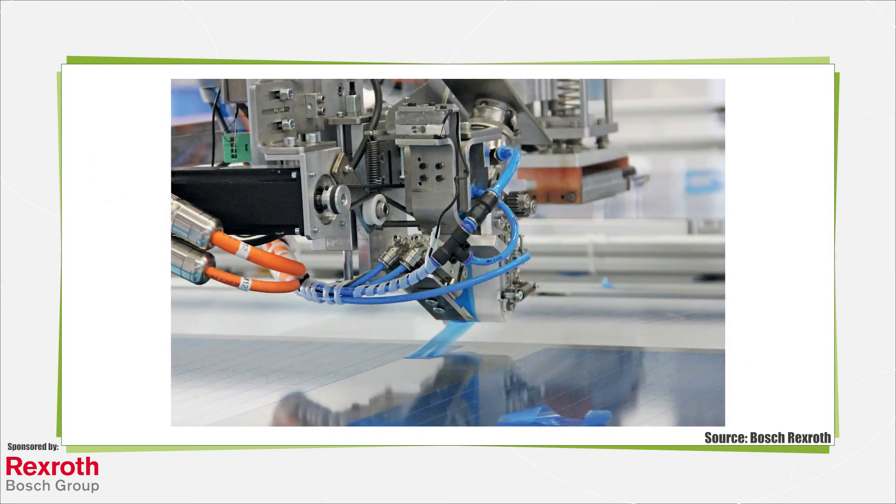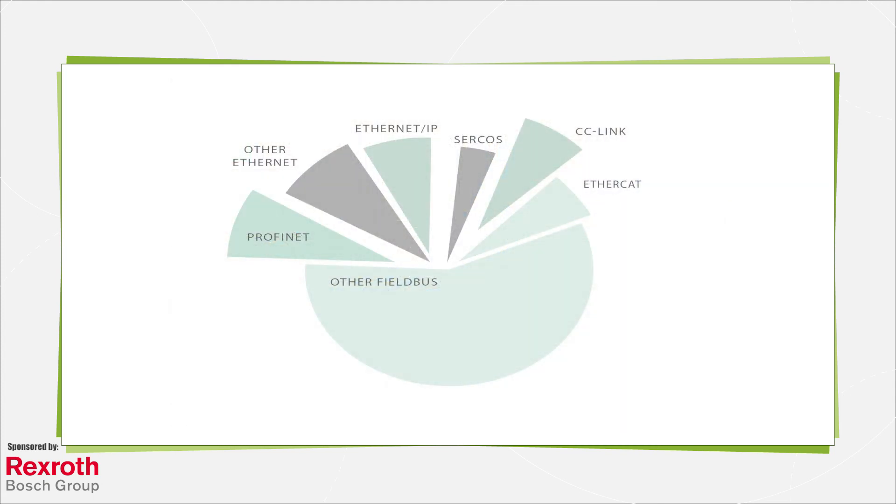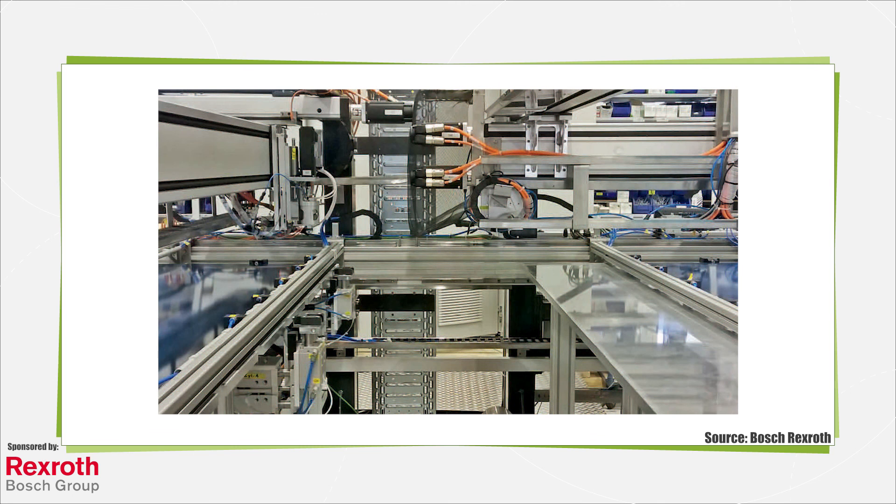Networking for today's motion controllers has become paramount, especially with precision and synchronization requirements that are more stringent than ever. Proprietary protocols and serial networking hardware endure, and field bus networks such as PROFIBUS persist and grow. IEC field buses also work in many of today's motion controllers. Though some field buses still offer reliability superior to that of non-deterministic Ethernet setups, Ethernet speeds now lead the industry. Five real-time protocols that provide deterministic networking essential to many motion controller functions include the Common Industrial Protocol (CIP) offering of EtherNet/IP, EtherCAT, CC-Link, PROFINET, and SERCOS3.